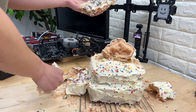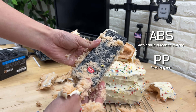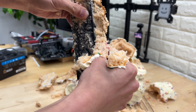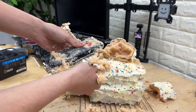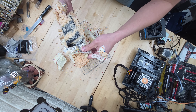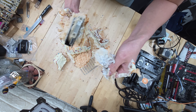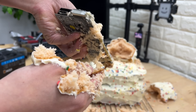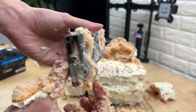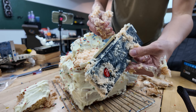I have to admit, I'm genuinely surprised the plastic exterior is still intact. Most GPU shrouds are made from either ABS plastic or polypropylene — both materials that have relatively low melting points, typically well below the 350 degree Fahrenheit temperature required to bake most cakes. So it seems like we're off to a favorable start. The HDMI port also looks pretty promising; it was wrapped in tinfoil during the baking process, so it's completely free of cake batter. However, the same cannot be said for the rest of the GPU, whose fan is completely jammed full of sugary coating, which has most certainly also invaded the underlying internals.